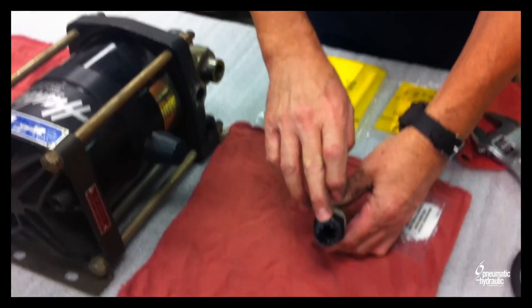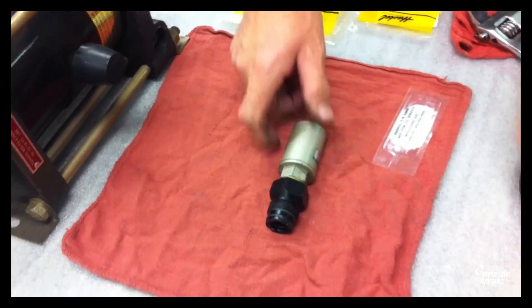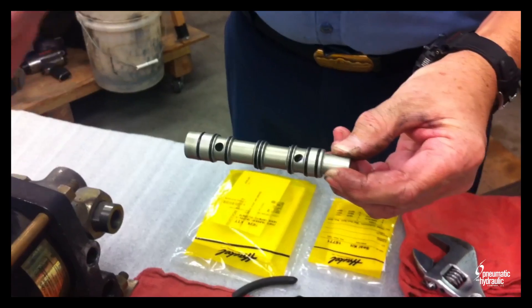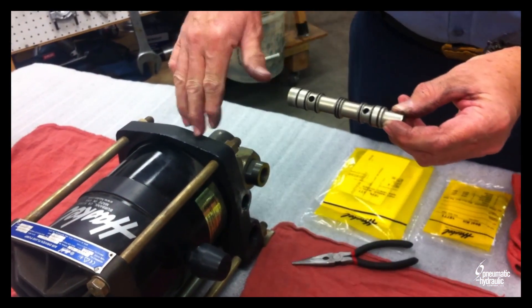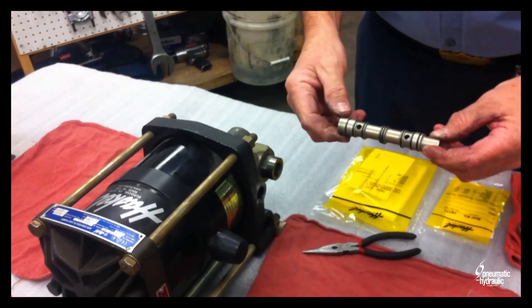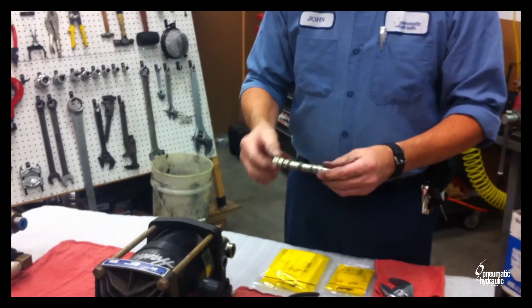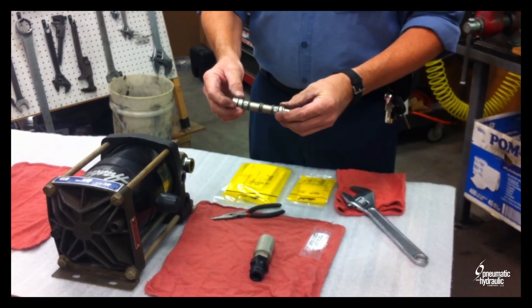Once you've verified that and tagged out your system, take a wrench, loosen up the retainer, and go ahead and unscrew it from the lower cap. There are two O-rings — an outer O-ring and an inner O-ring. Make sure that inner O-ring is there, as it seals on the end of the spool. This is your air cycling valve spool — this is what operates the pump. The pistons move up and down: one direction the air flows to push the piston up, the other direction the air is on top pushing it down. That's where you get reciprocation. Depending on how often you use the pump, that will determine when you need to inspect these O-rings and apply some Haskell lube to keep them running correctly.